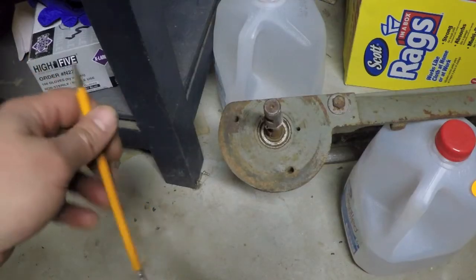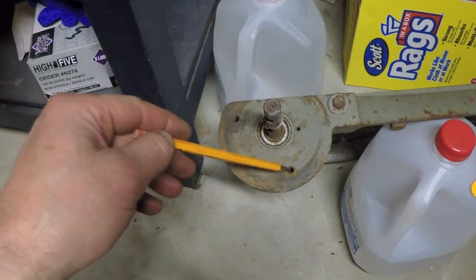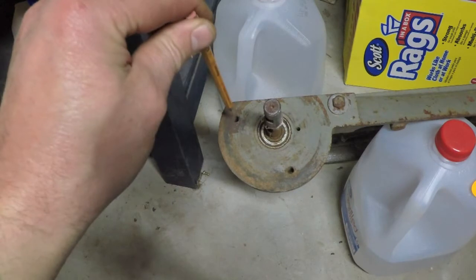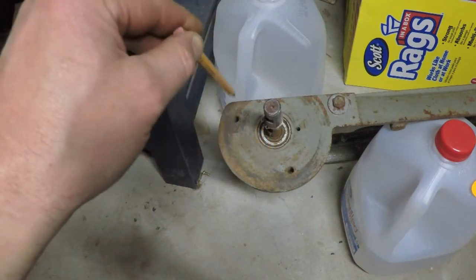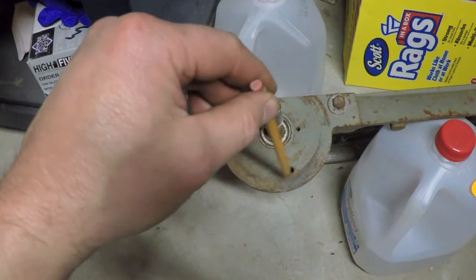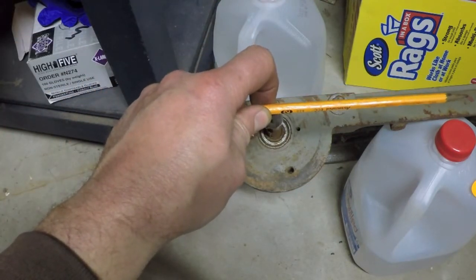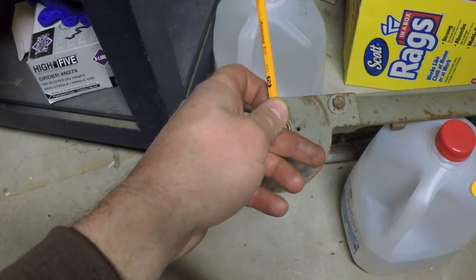All right. So the way this works is there's a bolt that threads into here and a bolt that threads into here. The bolts that thread into these two holes pass through two semicircular slots in the bracket so that when the bolts are loosened, the whole unit here can be turned from the horizontal position, which it's in right now, as an example, to fully vertical position, to convert it to a vertical sander.